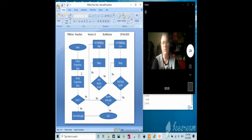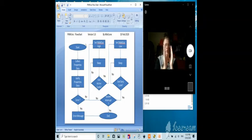And from this, we're now going to sit around and work out how to build this include file, this module. We're not doing the whole program. We're not dealing with the magnitude. We're not dealing with the debounce. We're only dealing with the PWM, the square wave. That's it. We're not worried about how big it is. We're not worried about how clean it is. We're not debouncing it. All we're doing is outputting it. That's all we're doing.